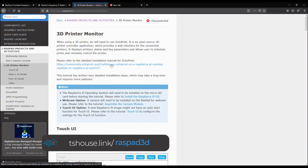If you've watched my recent OctoPi videos, that's another great application for this tablet. You can set up a remote monitor — so during a 3D print you could bring up the OctoPi web page on this device, sit it next to your 3D printer, and use the touch UI to manage and control your printer. Alternatively, you could fully dedicate this device by installing OctoPrint on the existing image, saving you an additional Raspberry Pi. You can connect via the USB ports on the side and pass a ribbon cable through to the Pi for things like LEDs.